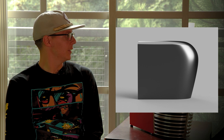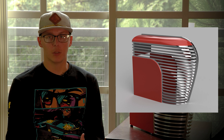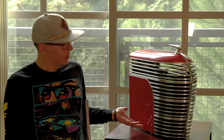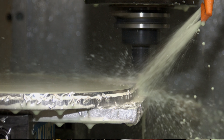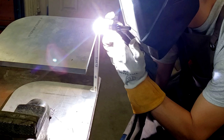The design of the exterior — I knew I was going to be making most of it out of aluminum, wanting it to look as close to an actual grill as possible and making sure it was manufacturable. Aluminum lets me do that. I started off by building the main frame, which is this red painted section in the back and the sheet metal that goes underneath. Those had to be the most sturdy because I knew I wanted it to open like an actual hood. Those are all made from half-inch thick plate aluminum. I CNC machined the side plates, and there are two cross members welded together, giving me a very rigid aluminum box to hang the grill off of from its hinge and mount all the hardware internally.